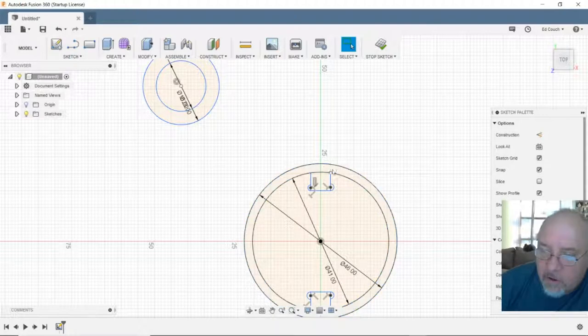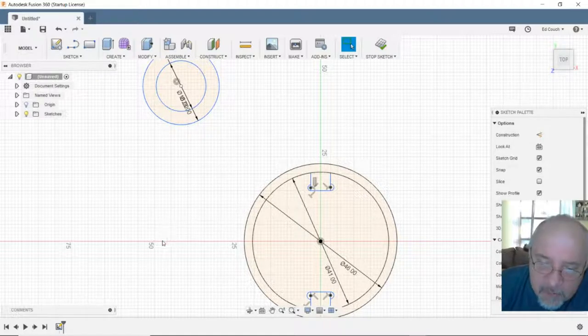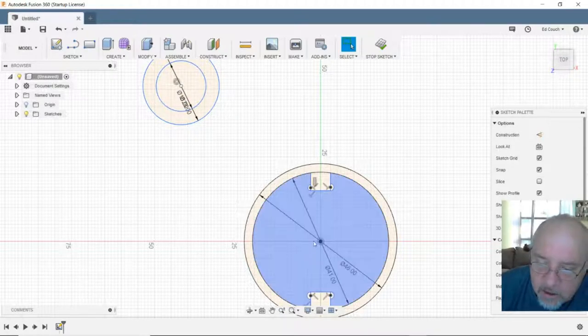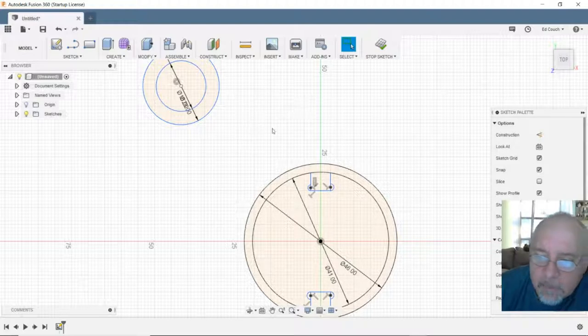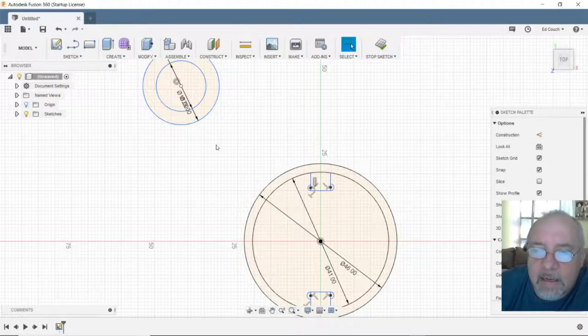And I hope I'm thinking correctly. I think that's going to work fine. It's worked good on all my other, my feet and my upper corners, so all those dimensions should work perfectly fine. Then, out in space, 42 millimeters off center and 46 millimeters off the center of this, because the motor should be where the center of the motor is. This should be the extrusion of the leg, and the motor is clamped onto the leg and coming out.